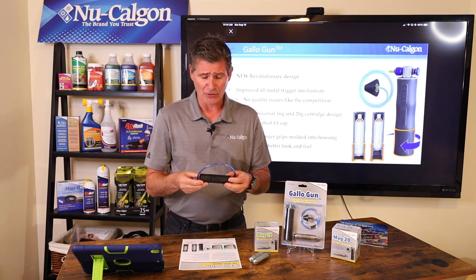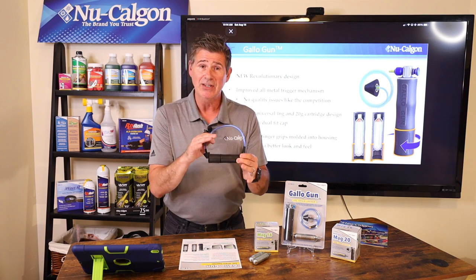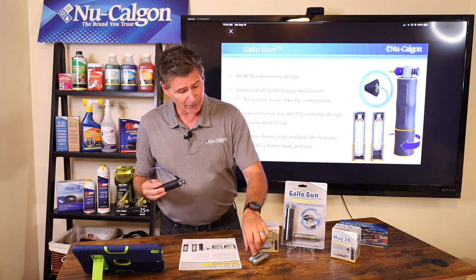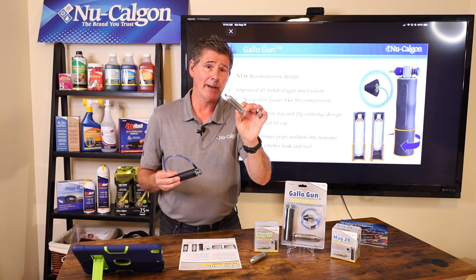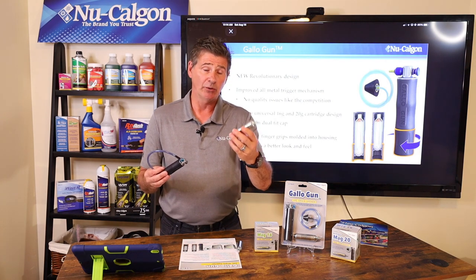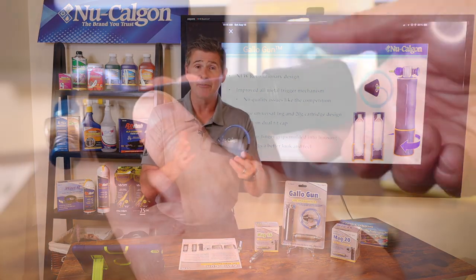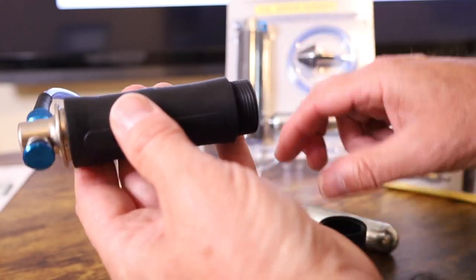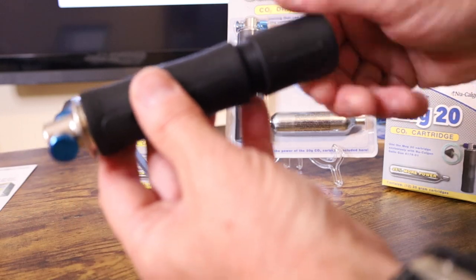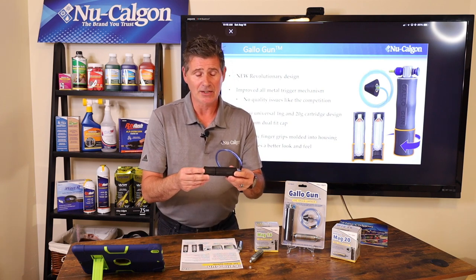What I think is one of the best features and benefits of the Gallo gun is simply the fact that this end cap — when you remove it — allows one gun to take both 16 and 20 gram cartridges. I've got a box of 16 and a box of 20 gram cartridges here. This is perfect because if a contractor wants to bill out one 16 gram cartridge per job, he's able to do that. And with the 20 gram cartridge, if he needs more of a push of air through the line, or wants to do two or three jobs with one 20 gram cartridge, he can do that too. The end cap is reversible and is marked with 16 and 20 gram on the bottom so you know which end is which. You simply unscrew the end cap on the bottom, take out the cartridge, and if you want to switch from 16 gram to 20 gram, you just reverse that bottom piece of the gun, screw it back on nice and tight, and you're good to go.